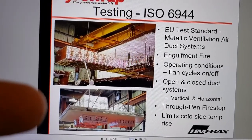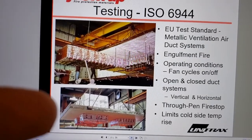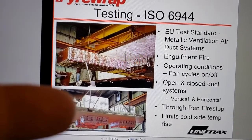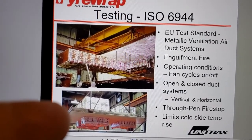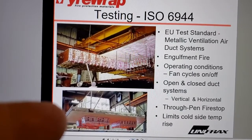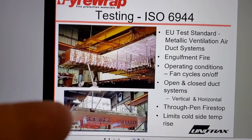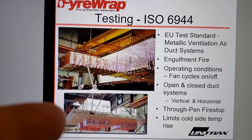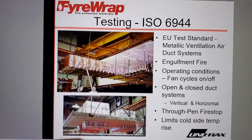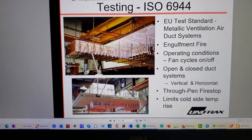Down below, you're seeing basically a fire stop test, right? And this is where the thermal measurement is taken. Notice too the fattening of the ductwork is kind of concealed if there's any on the unexposed side. But when you're only sticking, per E814, the fire stop test procedure, a foot of the penetrant into the furnace, and then you wrap it nice and thick, then you can get yourself a T rating, right? And looks like in this case here, the wrap maybe goes all the way around, even the bottom. Not quite certain from that picture.